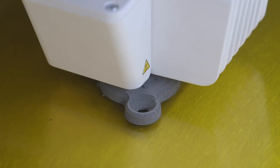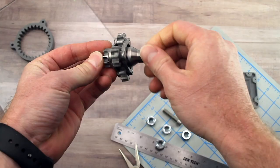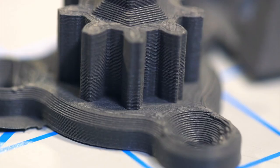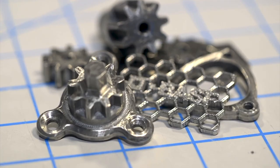So what are our customers and ourselves using this material for? We're using it in jigs and fixtures, small series prototypes, and basically replication of metal parts in situations that either were too cost prohibitive or had tight time requirements. There's very little lead time — we don't have a mold to make, we don't have tools to buy, we have a printer. Once you have a printing solution you print it, debound, sinter it, and you have a metal part.